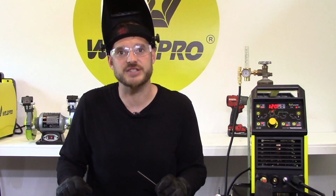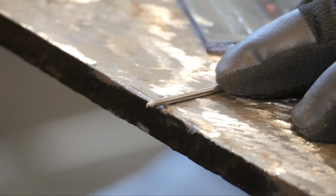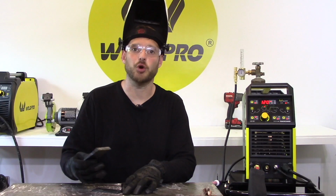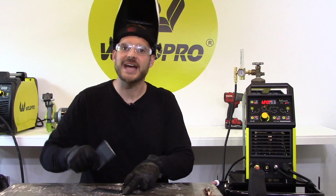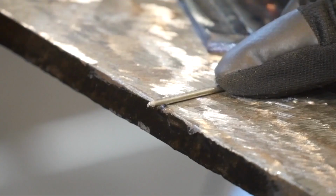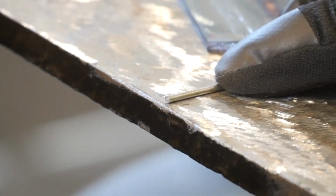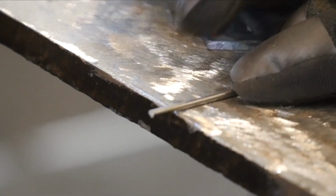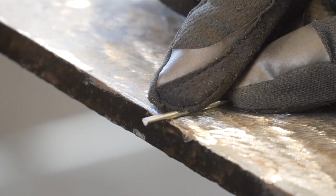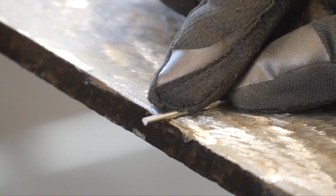You can do this using a vise, a pair of vise grips, or just the edge of a hard surface. While holding your tungsten over the squared, hard edge of a surface, take a hammer or another heavy piece of steel and tap the tip of the tungsten. It should snap right off. Okay, you'll see we have a new square edge on our tungsten. We're ready to grind one more time.